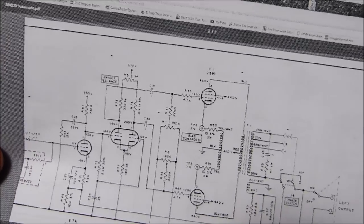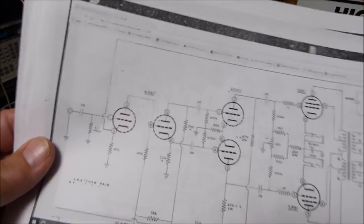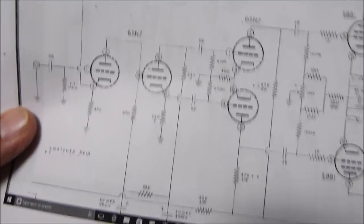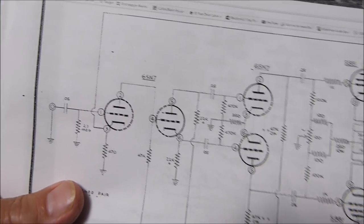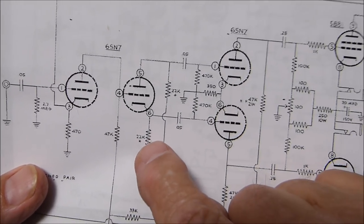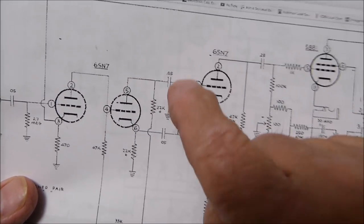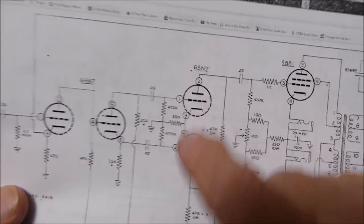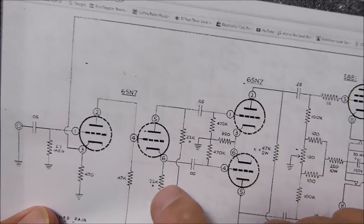And, let's start here for a second. Let's look at this amplifier. And there are some components in here that you see just characteristically in all of the amps. And they nearly, virtually every one of them, for this phase inverter, so that you got your signal 180 degrees out of phase, they nearly always put an asterisk by these, this one and this one, and say they want them to be matched pairs.